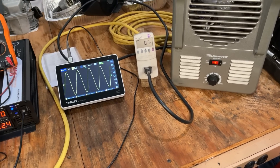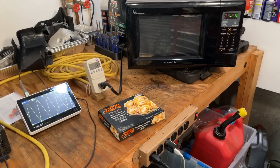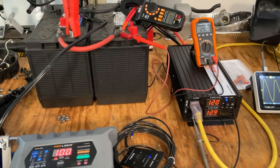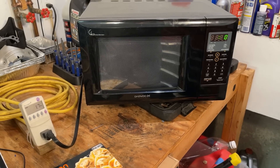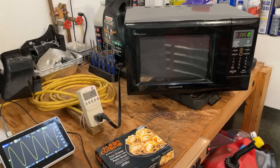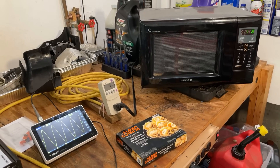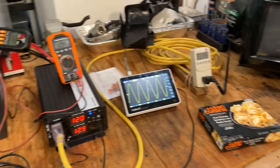Let's break out the microwave. I've got the microwave set up — I'm going to try cooking this meal, which needs to be cooked for four minutes. I think it's going to be a bit of a challenge, not for the inverter, but for those batteries. Microwaves have a huge surge associated with them. This one pulls about 1500 continuous watts, but to start a microwave you're going to need probably closer to 3000 watts, maybe a little bit more. Actually, my first generator ever owned was a 3250 watt generator, and it could not power my microwave — it would fall on its face and stall. So this will be a good test. I think the inverter can do it, assuming the batteries are up to it. Let's give it a go.